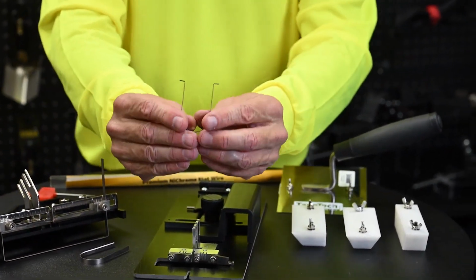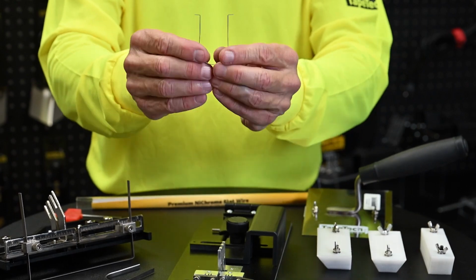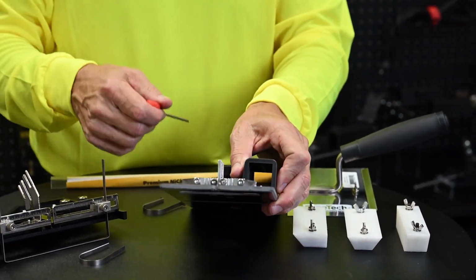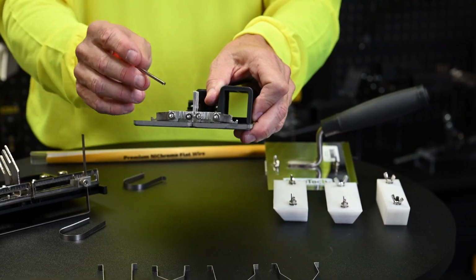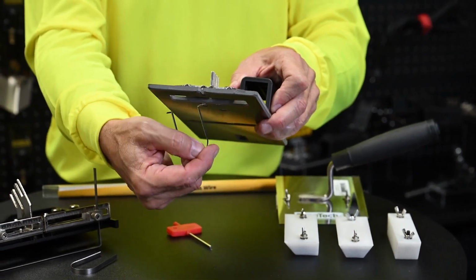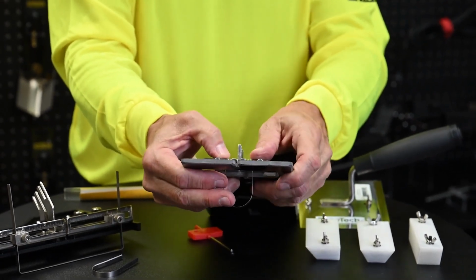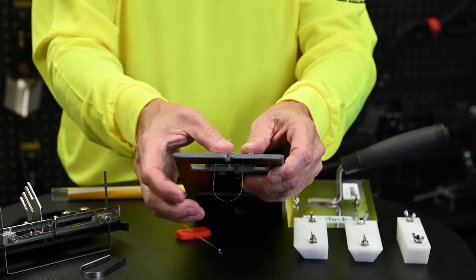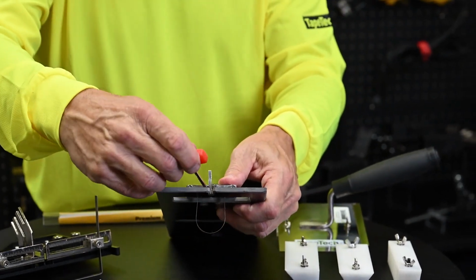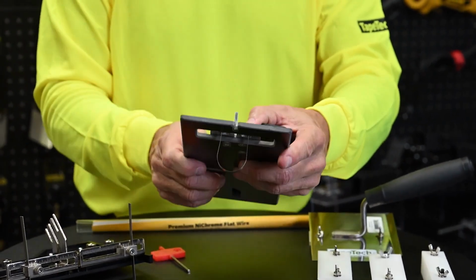The TapeTech system has 2 legs, and this gives you a predetermined size and shape and dimension for exactly what you're trying to achieve. Also notice that we've designed this adapter so that the arms just swing up and out of the way. So instead of trying to feed your grooving blade through 2 little slots, you can now just attack it from the front. Put it in, push it down till the legs hit. And this blade is in the perfect position every time.